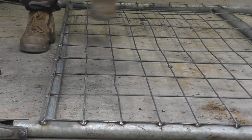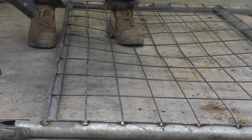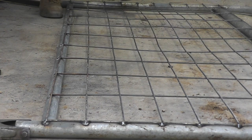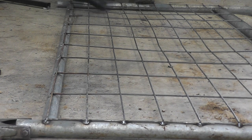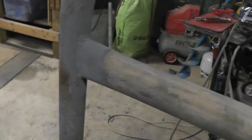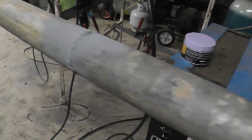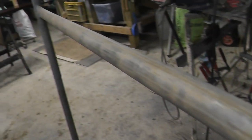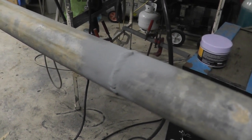I decided I did like the way those pressed ends finish up, so I had a go at doing another one — and I've got an admission to make. I got those two pressed ends out of parallel. So I cut it, orientated the ends correctly, and then welded it in the middle. The good thing with welding is that there's not often something that's irretrievable.